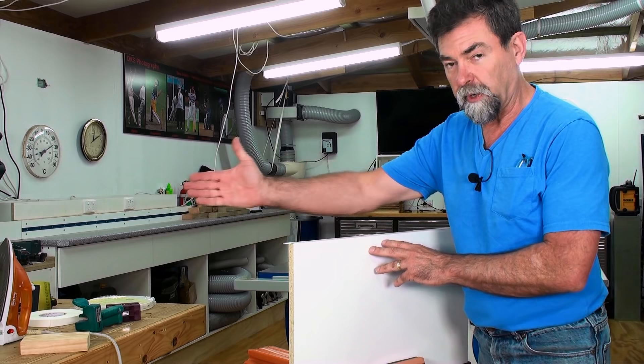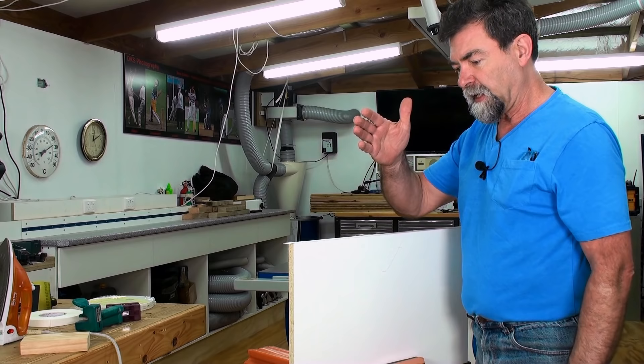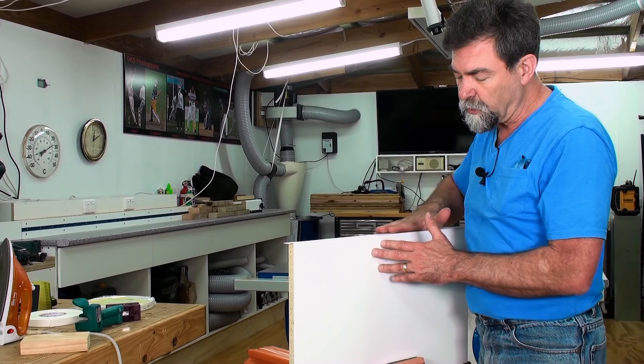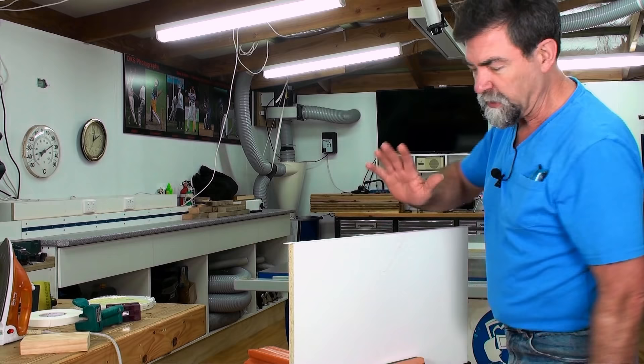The reason I do it like this is that I don't want the tape to wander off. I like to get the tape glued on in one run and then come back over with the heat again to reactivate the glue and push that block down hard as I'm following along behind it. The tape is held in position because I've already previously glued it. For a really long run that can be a little bit problematic — you might find you start to get a little bit of a hump in the tape — but for short lengths like this, this is best.